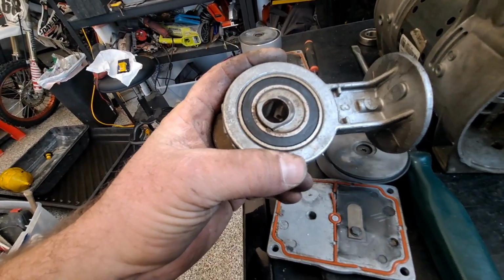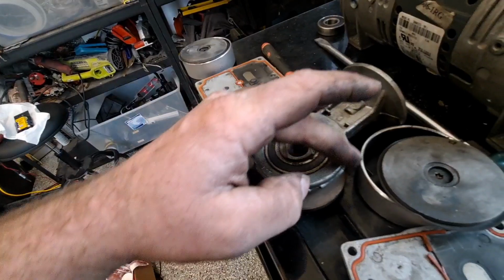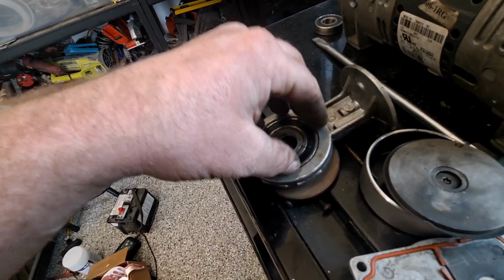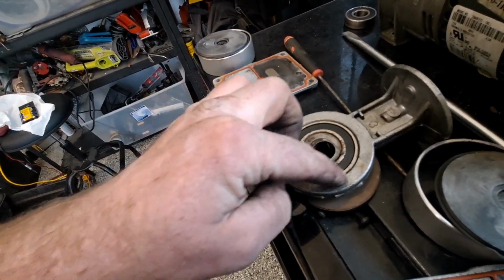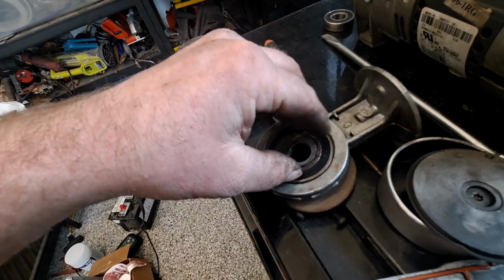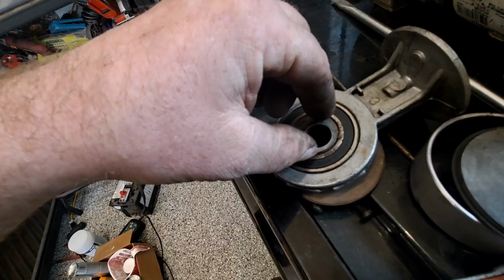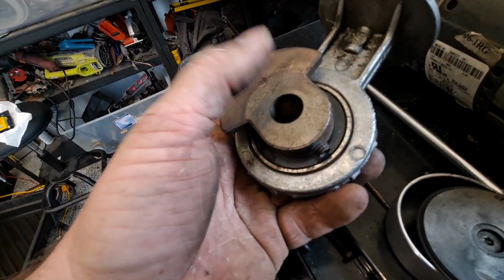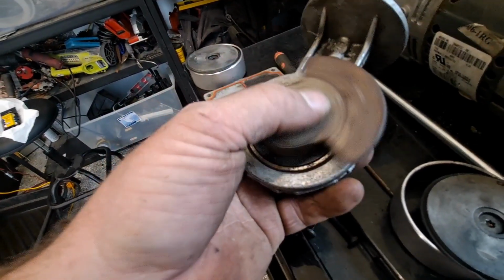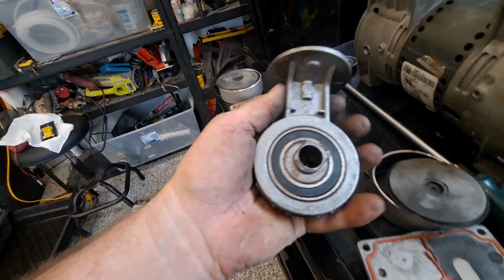And then the thing would be to get a big old socket or a big circular part, right, to support the rod, and then get another big part to support the outer race, drive the outer race right into the rod, and then get a socket to support the inner race, lay it on the socket, and then drive this counterweight or whatever, the centerpiece, into that inner race. So it really wouldn't be crazy. It's the same type of concept.